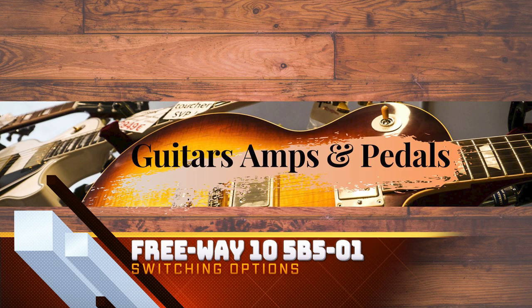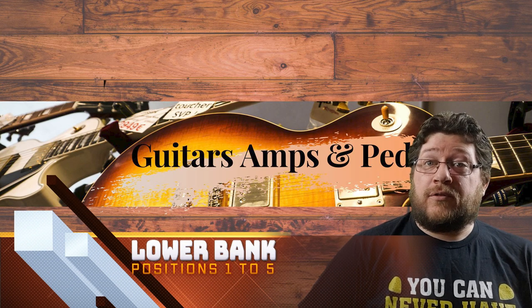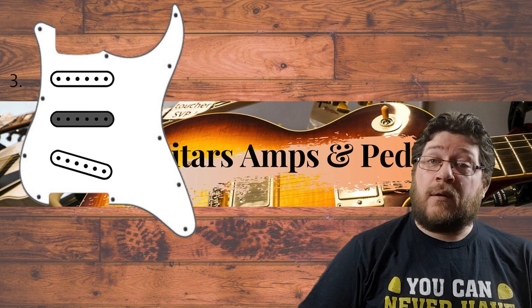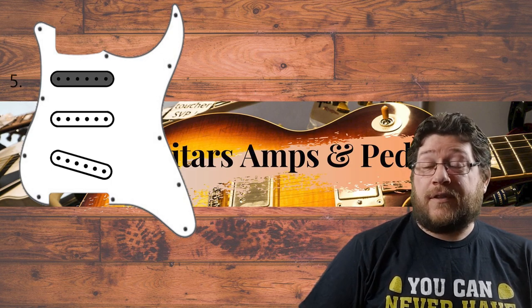So what pickup options has the Freeway switch given us? Well, the lower bank gives the normal Strat wiring options. So in position 1, you've got the bridge. Position 2, we have the middle and bridge. Position 3, the middle on its own. Position 4, the middle and the neck, and position 5, the neck on its own.